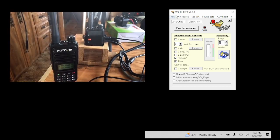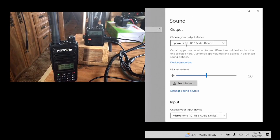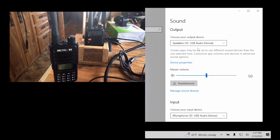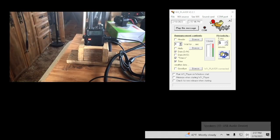If you're having problems with sound after doing all this, go into your sound settings — search for 'Sound,' select Sound Settings — and double-check that everything matches. In my case the speaker output must say number 10 since I'm using the USB sound card. Also check the microphone setting. If one of these is different, it's not going to work. Another common issue from emails I get: people can't hear it because the volume on the radio isn't up high enough, or the volume on the computer isn't high enough. Always start at least halfway and tweak from there.